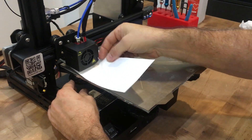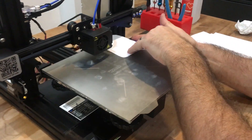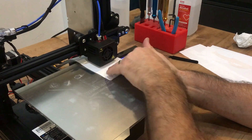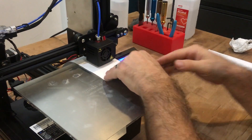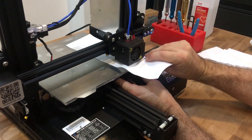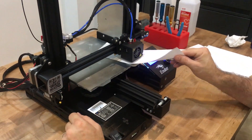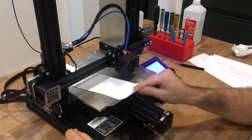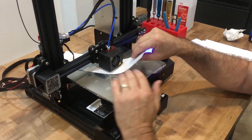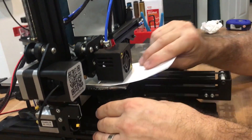Too loose. Too tight. There it is — I'm going to go around all four corners, repeating this process until I'm not touching any corner at all. The reason why is because every time you adjust one corner, you're kind of setting the other ones off. So we want to try to get them all generally in the correct vicinity, then fine-tune. There's a center verification point — I don't adjust when it's at the center, it's just to see how flat the bed is.